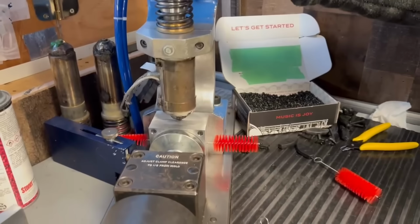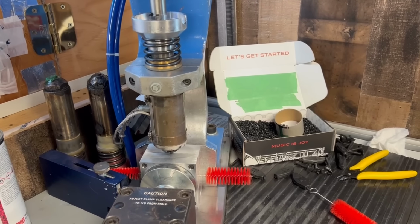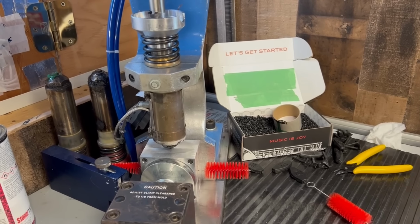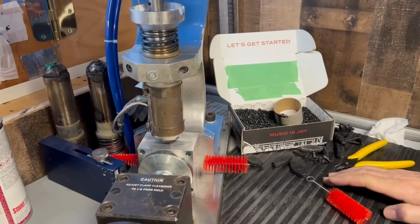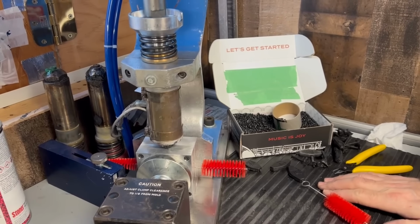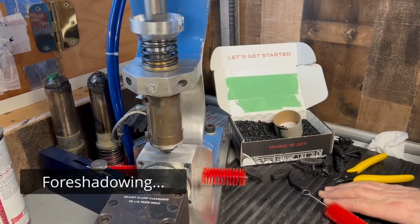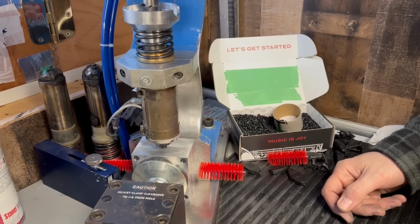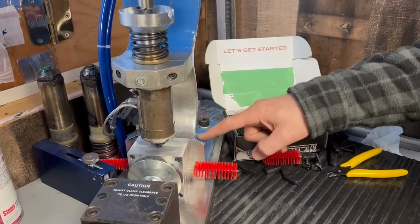Let's make sure we have lots of good stuff here to compress. Yep. And we're not worried about pressure as much anymore, so we're going to go high pressure to 60. That's not really high pressure, but you know what I mean. See if we can really pack it in without it splooshing out, and really push the mold. Yeah, look how much that pushed. Did you have it on the maximum hold time? Yes. I mean, for injection time? Injection time was 7 seconds, hold time's 10.